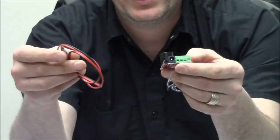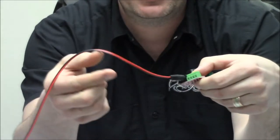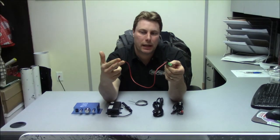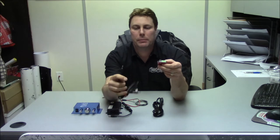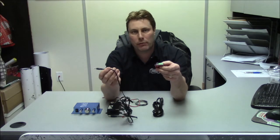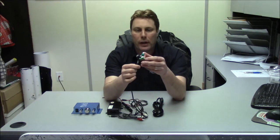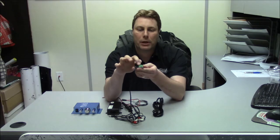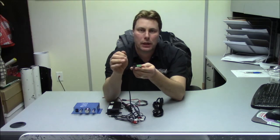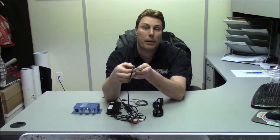We provide the Pi amp with a barrel connector for your power supply, which just pops in there. As mentioned, red denotes 5 volt in Canada but it's actually 12 volt — that's just the way the cable comes. You connect it to your 12 volt and ground, then take a 3.5mm headphone cable from your computer or Raspberry Pi audio out into the audio in on the amplifier. The amp outputs left and right via screw terminals — positive and negative — going to your two speakers. To add more speakers, you'll need to splice and double up the wires.